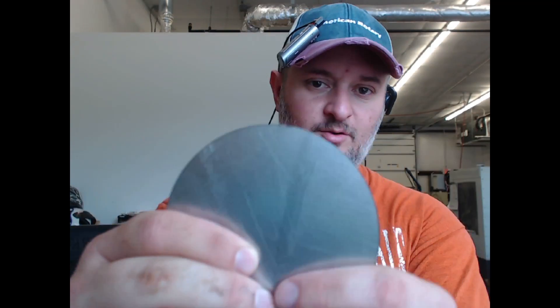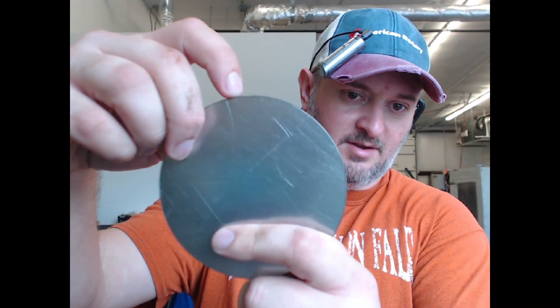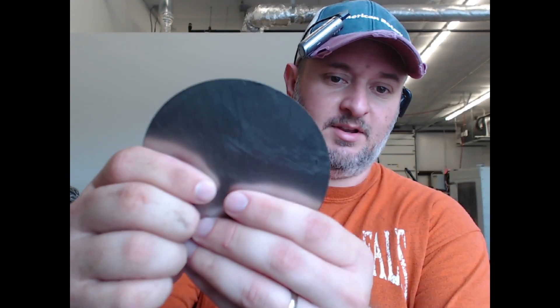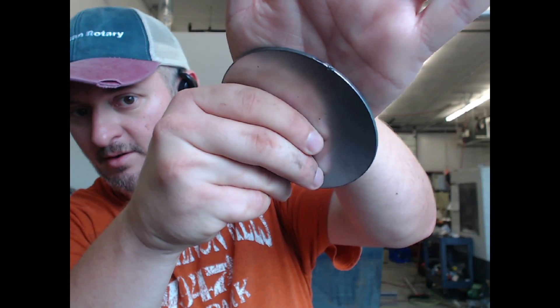Let's talk about the quality, which is the real reason we do this. Every time I use Design Edge with that straight lead-in, I get this little pip right here — you can really see it, it's a divot right where the cutter comes in. We don't want that. With the Fusion arc lead-in approach, you don't get it. There's some leftover dross I could dial in better, but basically I get a much cleaner cut. This isn't the best example — I probably should have used something thicker; this is 14 gauge.